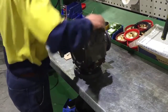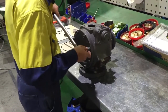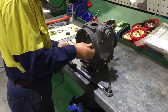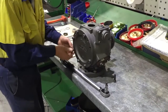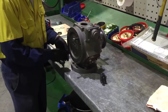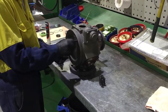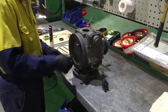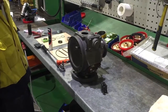Remove the eight tap screws. If required, put two of the screws into the tap jacking holes. Remove the cover. Please note that the cover is a very neat fit into the body. Do not use excessive force to remove the cover. If the cover gets stuck, gently rock loose or gently tap loose with a soft mallet.